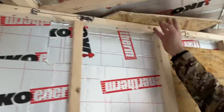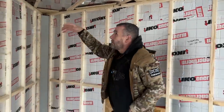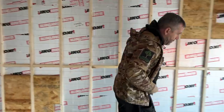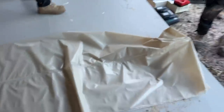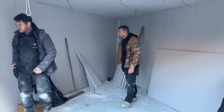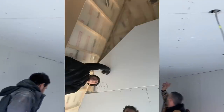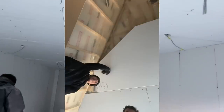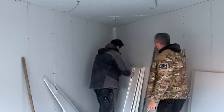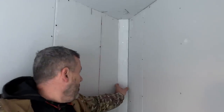David will go outside and tuck loads of rock wool up where we couldn't get PIR. We're going to staple that moisture barrier up and then have a go at plasterboarding the ceiling - it's practically plasterboarded now. We tried to put it as full of boards as we could - we messed that one up, I don't know what we were thinking in there, but we've got it right now. At the back there I've just flattened off that corner so that he can get his trowel in, and that'll be a little chamfer so we can plaster that properly.